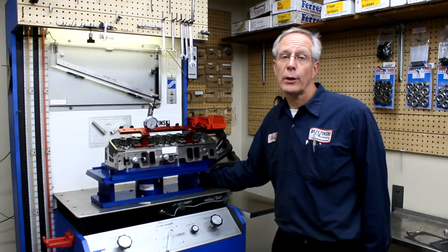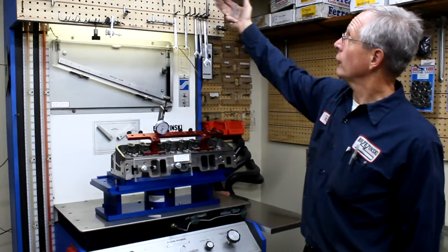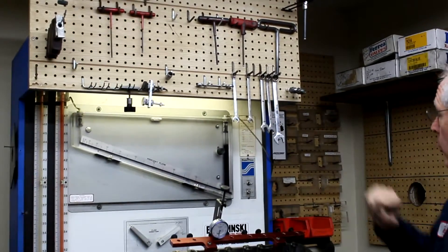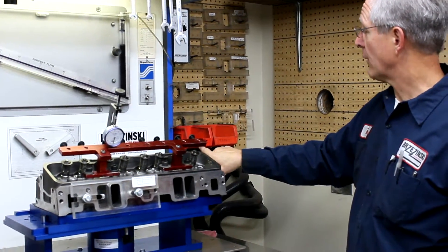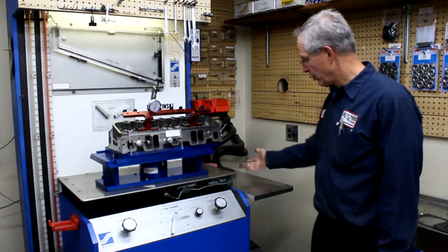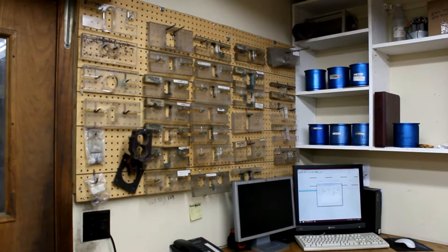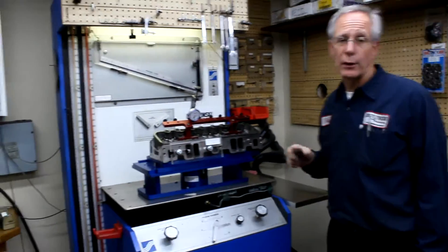One of the areas that people really overlook is organization around the flow bench. The flow bench is just like any other machine shop — the tooling needs to be organized. What we have here is just a pegboard bolted to the front of the flow bench with hooks, all of the Allen wrenches we need, all of the regular wrenches, spark plugs. We have a couple of bins with fabricated holders for fasteners for flow guides and some metric fasteners. We made this little stainless steel shelf to put things on when you're flow testing. In the back, we have all of our flow guides organized — we have about 53 different flow guides. So try not to fight what you're doing; spend a few hours organizing your work area.